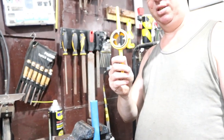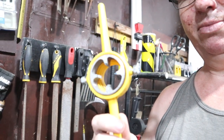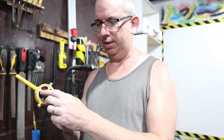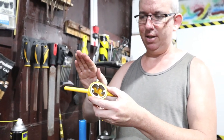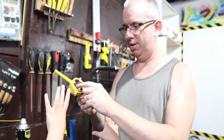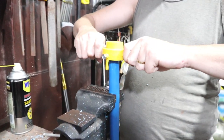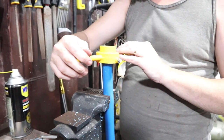So I've got the PVC threader. It's pretty much like any other threader that you buy, but this is made for PVC pipe. I already got it installed. You know which side to put facing down because the side that starts the cut always leans, and the other side is straight up and down. So if it's leaning the wrong way, it's upside down. Just line it up like this first. Make sure it grabs and it's straight, and slowly turn it.